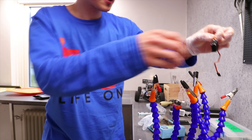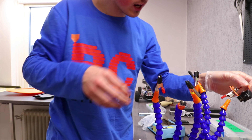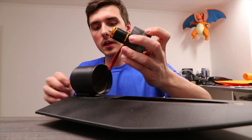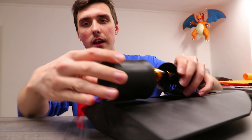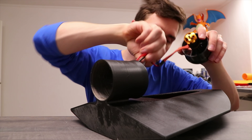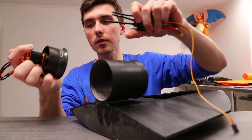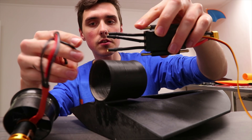Very delicate waterproofing — a little silicone a day keeps the water away. The EDF fan will be mounted just like so, and there's a channel going into the boat for the connectors. But I made that hole too small — how do you mess up a hole? So the three bullet connectors from the EDF will be connected to the ESC just like so.